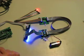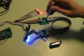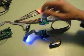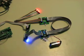So if we do the dry relay — we do have a delay on turn-on time — if I just delay that turn-on time a little bit, you can see now the relay does not turn on right away with the short one. We actually have to build up some heat in here.